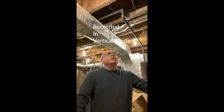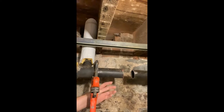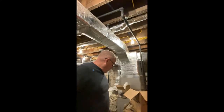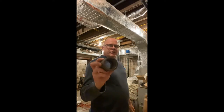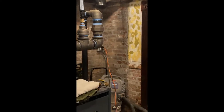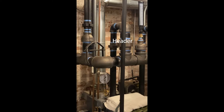All right guys, I'm Mike the Worker. Today we're going to try to fix the steam pipe so we can get a second radiator in - basically we're trying to get another T in here to go up to the radiator. One thing I want to tell you about: when you use pipes and fittings, use Ward - American-made threads are always good. We're in the main line, it's a two-inch main line that basically feeds to this boiler. I just got done doing the upper headers to try to reduce the amount of condensation that gets in the system.